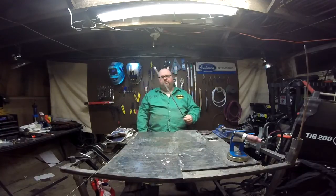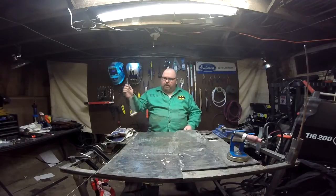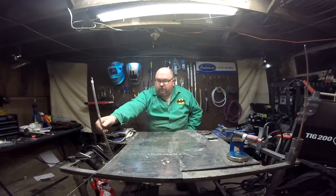Today we're going to be checking out a new product from Dave Bro Incorporated called Easy Weld TIG wire. It comes in 1/16th inch diameter — I think he also has it in 3/32nd — in 36-inch lengths. And his claim to fame, according to Dale Davidson the owner, is that you can weld cast iron with it with no preheating and no post heating, and that is because of an additive he discovered over 30 years ago.